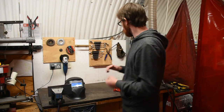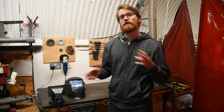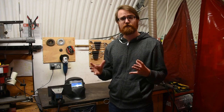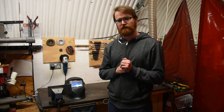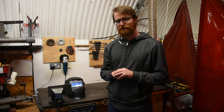It's important to treat the gas cylinders well. There is a potential for them to be moved around, so they should be chained to the cart at all times so they can't tip over. The tops of these containers, while the container itself is steel, are made out of very soft brass. If they are hit or fall, they can cause the cylinder to go off like a rocket. So we want to avoid that.